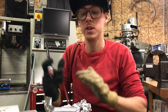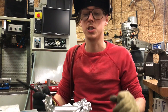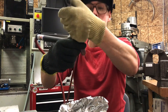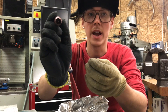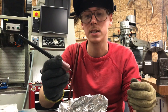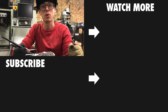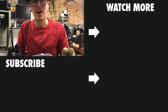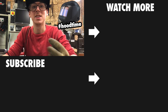Next time you find yourself really trying to maximize your shielding gas potential, give this a shot. Make yourself a little dam and get in there. You can extend your tungsten — this is pretty normal for me with this number eight cup — and in the instance of tight seat stays or something, quite a bit more. With the right piece of tin foil, you can really get the coverage quite adequate. Anyway, I hope you found the video useful — hit that subscribe button and we'll see you on the next one.